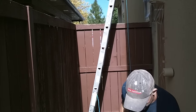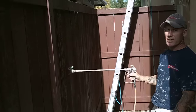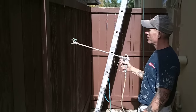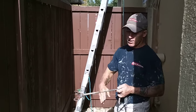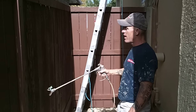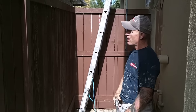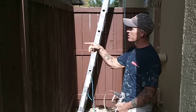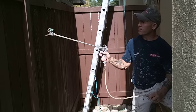When we're actually spraying this fence, there's a lot of quarter inch gap in these pickets. If you spray dead on, it's going to send overspray through the picket, so we're going to want to be spraying at a slight angle, probably a 45 degree angle. Same if there's any big knot holes — if you spray straight through the knot hole, it's going to shoot overspray to the other side of the fence.